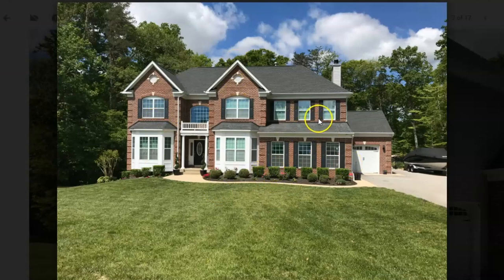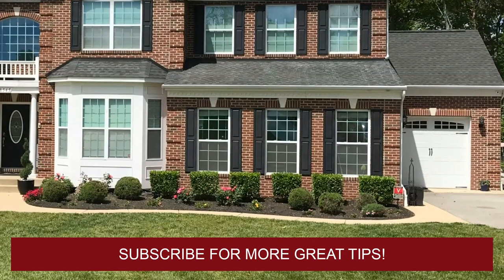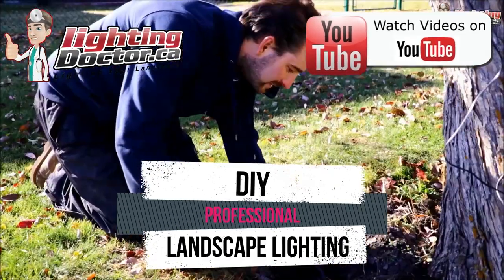So that's what I would do: four lights across here, two higher ones here, and I would try to get two in between the windows here. The garage might be a little tricky because you have the stone there. I'm just going to see if I got a better picture. I probably wouldn't worry too much about that area — it's going to be very tough to do, but you could try mounting some lights up here. All the lights have a half-inch thread, so you could get some of those white flanges and run the wire up in the gutter wherever you need to.